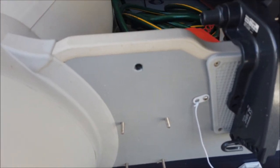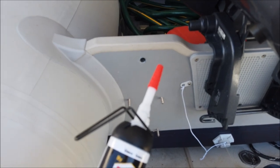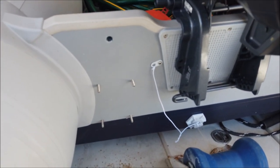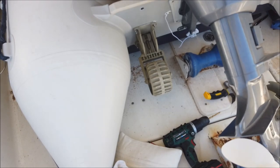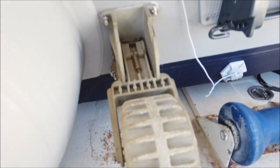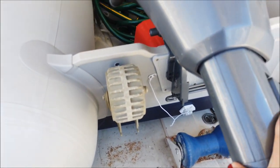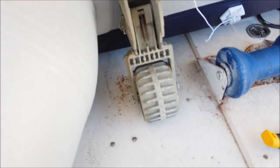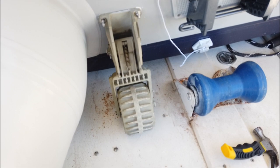That's it in its up position and obviously it will be reversed when the wheels are put down, with the wheel slightly below the bottom of the transom so that we can tow it up the beach. We've drilled the holes and got the bolts through from the other side where it takes the wheels. The next thing to do is circle each hole with some silicone to make sure they're sealed and don't let water in, then offer up the dinghy wheel and put the nuts on the front. We've got nylon locking nuts to make sure they don't come loose with all the bouncing around and trundling up beaches.